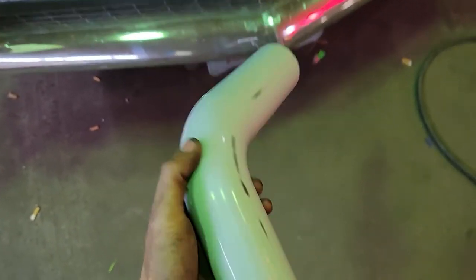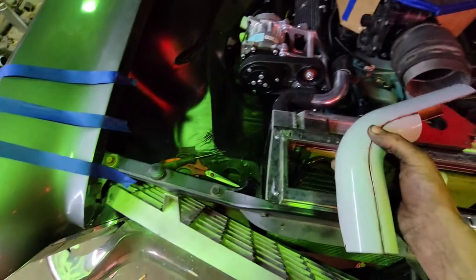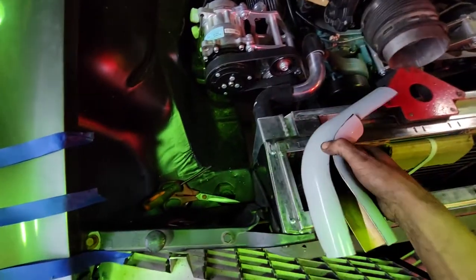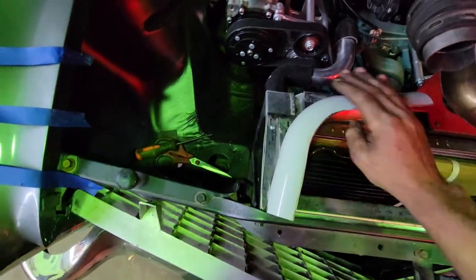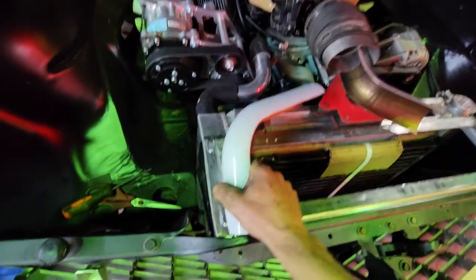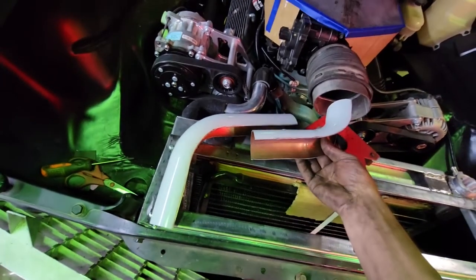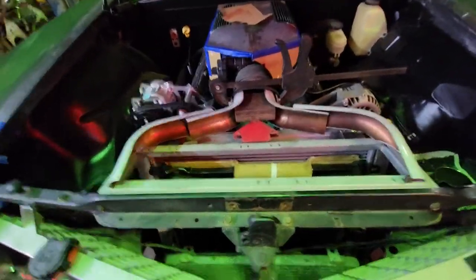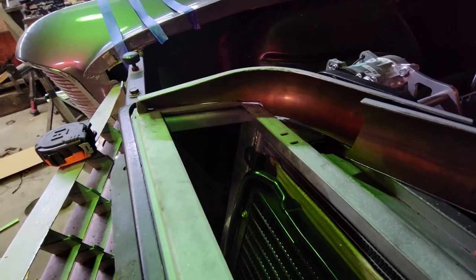Here's an old trick if you need to cut a bend in half. Here's my tube diced in half — I also notched that one already, so I've got the bottom notched out. Looking like it's going to work. The inside of my bend I can just flip around and use there — it's going to work nice. I'll get my vacuum cleaner attachment dialed in here. I've got this side notched in to fit decent, and I've got to transfer that same notch over to the other side.